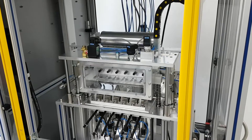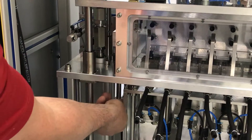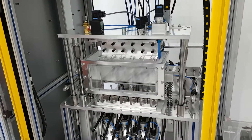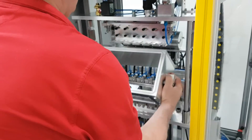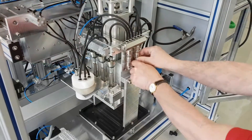When maintenance work on the ink filling mechanism becomes necessary, the vacuum chamber walls are removable after disassembling two stopper nuts, opening up the area for the work. This previously had to be done inside and under the chamber on the previous machine model. Additionally, the syringe unit has been equipped with easily disconnectable and drop-free connectors at the ink inlets.